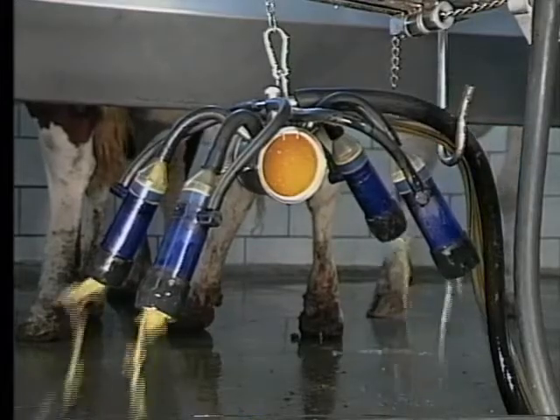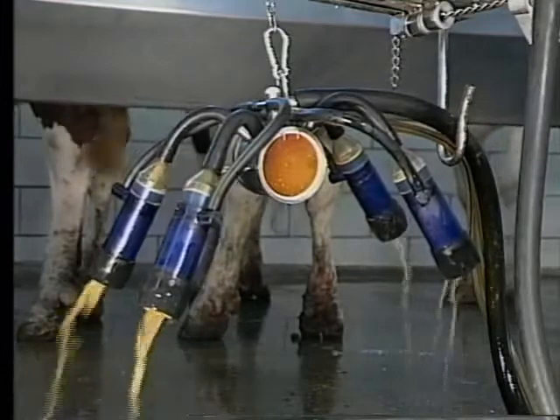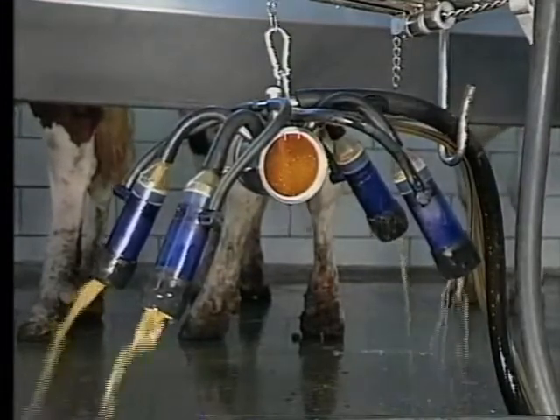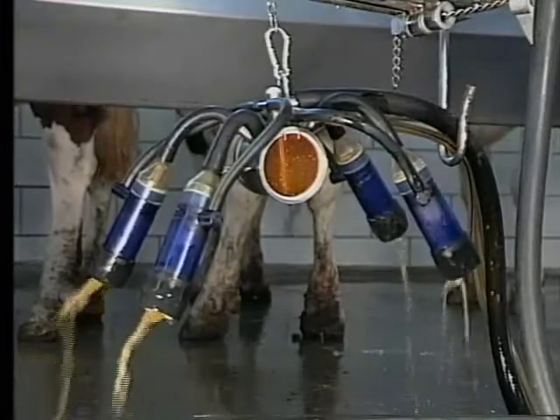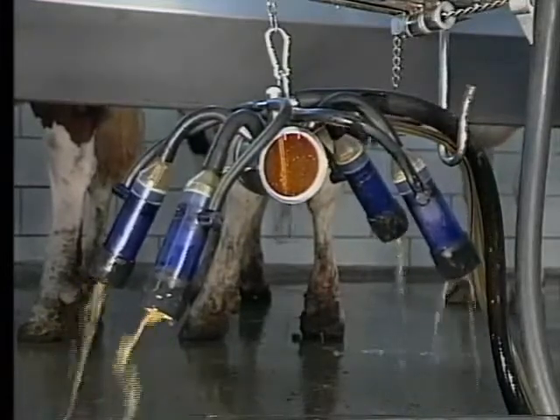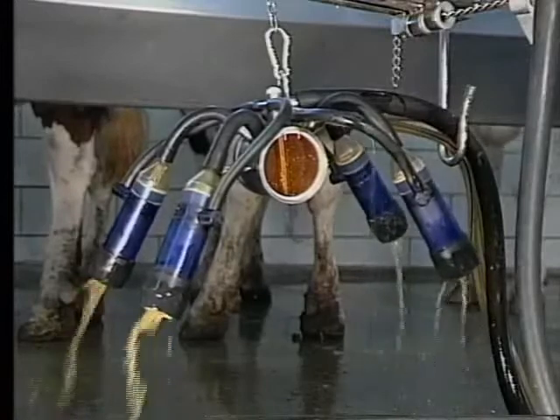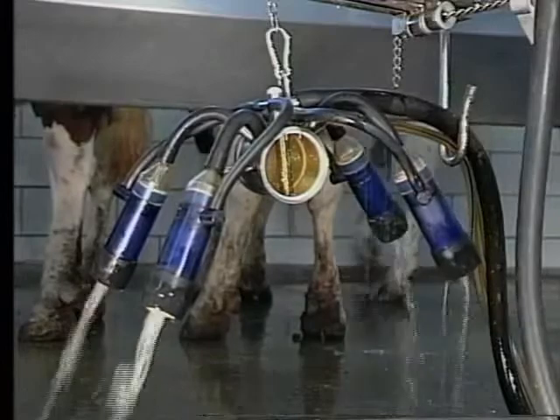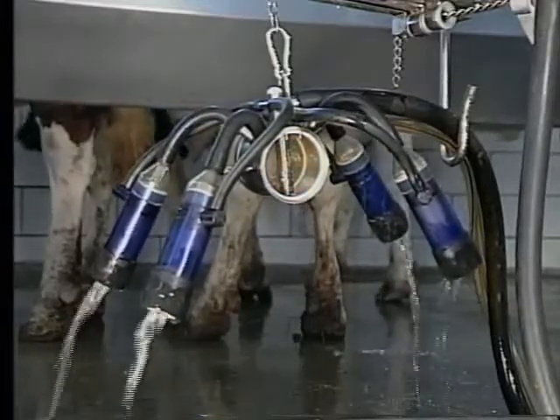This is what we had in mind: top outlet claw on arm takeoff, flushing right side up. The entire claw is pressurized, filled with solution, and as a bonus they even clean the air bleed hole every time we back flush. It's the one and only way to go.